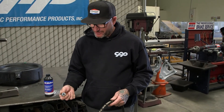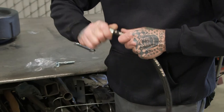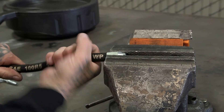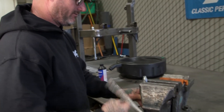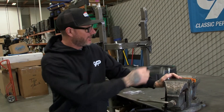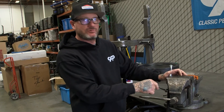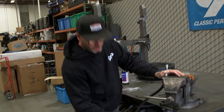It's pretty simple. High pressure fitting, high pressure hose — the hose is good for over 2,200 PSI. We're going to thread the first part of the fitting on; it's easy to do in the vise. When installing your fittings, the nut has left-handed threads and the fitting has right-handed threads. When you're working with anything other than a straight fitting, you're going to have to index the fitting to the hose because it needs to be clocked a certain way — this hose will not twist.